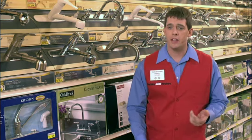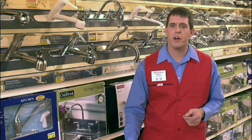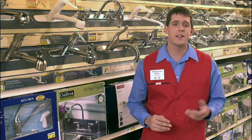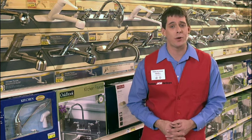Start with turning off your water. Then you're going to take apart your faucet until you get into the valve unit and find this. But be sure to take your faucet apart before you go to the store to buy a replacement washer, because there are a lot of washer sizes and you need the exact match. The best way to find that match is to take your old washer to the store with you.